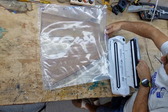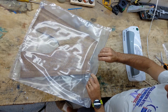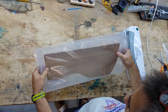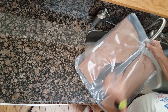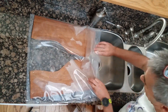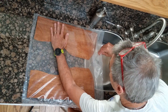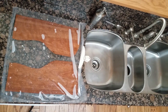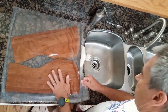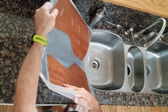My bag is finished, but I've left about a 2 inch gap in the side to fill it with water. Just a final check that I have the board orientated correctly — now off to the kitchen. I'm filling it with hot water, only putting enough in to completely cover the boards, say about a pint. You don't want the bag so full that it bursts all over the kitchen floor. When I've excluded all the air, I clamp it shut with a bag clamp and leave things to soak for maybe 15 minutes or so, till the wood is nicely saturated. Then drain as much of the water out as you can, and it's back to the workbench.